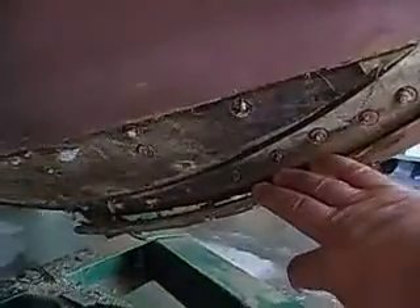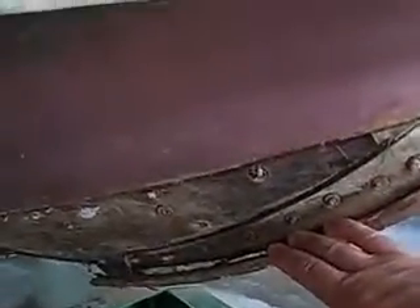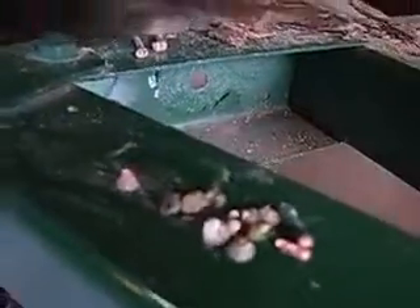This piece had been damaged — somebody had run into something — and that was the reason for the epoxy. The other thing we're concerned about as we're going through this is most of these screws are just crumbling. There's almost no screw left right there, and here's some pieces that are crumbling off. So this is not normal. This is maybe some electrolysis, or maybe somebody had this boat in salt water with some stray current. I don't know — it could be in fresh water and stray current — but we're a little concerned about that.